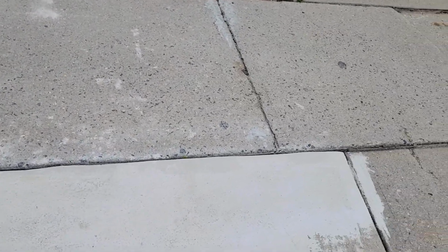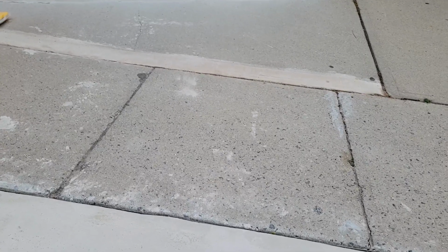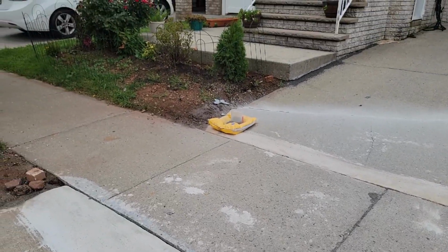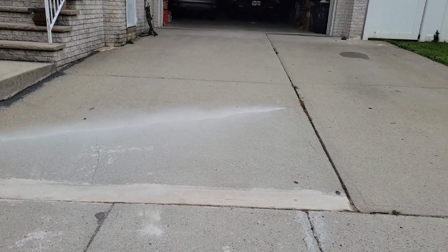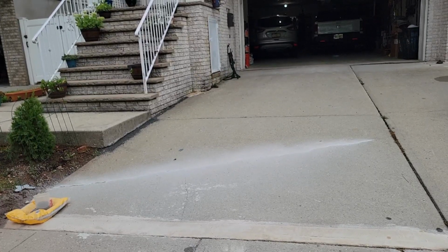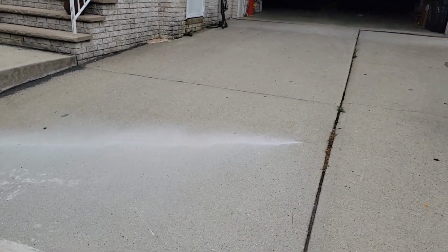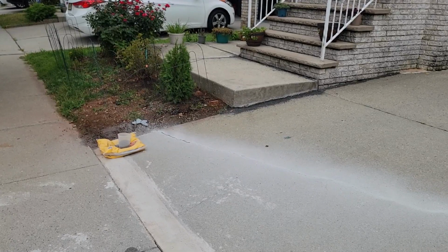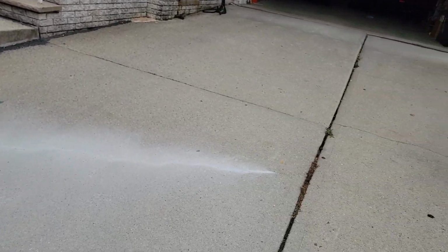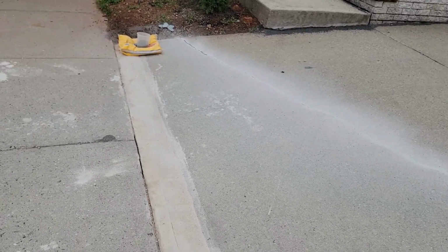Honestly, this is just a patch for this year, just to cover this. Probably next year or the following one, it all depends on how my economy is. I'm gonna try to get all this done in, could be cement number 5, I think it is. I know it's commercial grade 5 cement, or I'm gonna get stone, one of the two. I'm just thinking which is gonna be the best, but I have to remove all this concrete from this area and use a compactor. Some guys told me a 6,000 pound compactor in order to make this real good, and if I don't want these problems again, well, they know better than me. I'm just doing this job following the advice, the way my friend Mike does it in Pennsylvania.